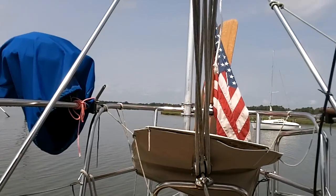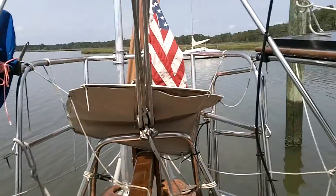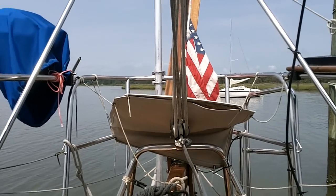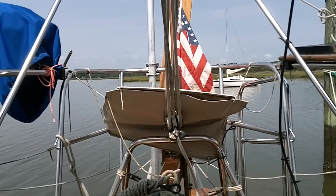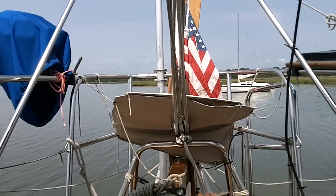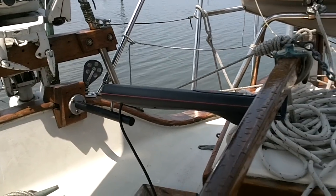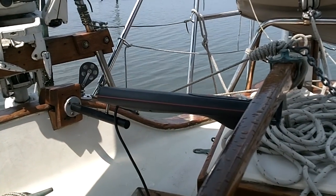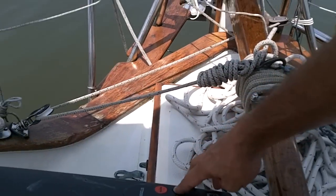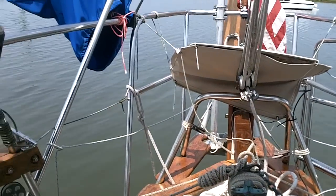This chain will be pulled — the chain is attached to the tiller, this stick right here. Once the boat comes back to its heading relative to the wind, the tiller centers and the boat sails on its way. Very cool. It doesn't require any electricity and steers the boat very well. In addition to the mechanical self-steering, we have a couple of electric autopilots. What they do is pick up a magnetic course, and if the boat deviates, it causes the arm to extend or retract, bringing you back to course. We have two of those, as well as the wind vane self-steering.